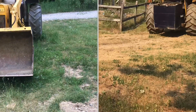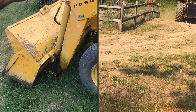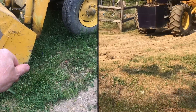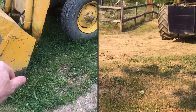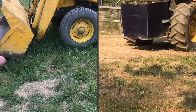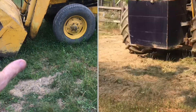Sometimes I use a tractor as a grader. Instead of using the scoop, I only use the loader to raise and lower the scoop. Right down here is a cutting edge, so you can raise and lower that and use the back wheels to keep everything straight in the dirt. And if you have too much dirt, you can slightly lift it up and just work it back and forth.